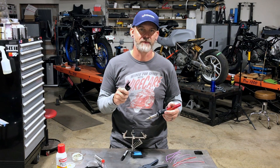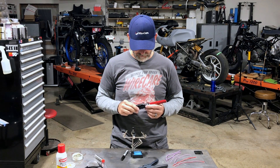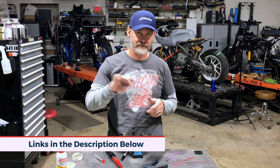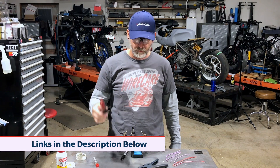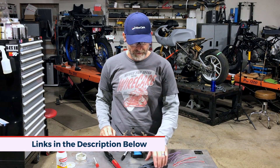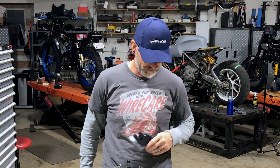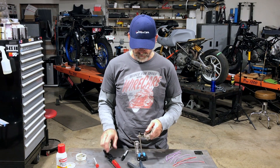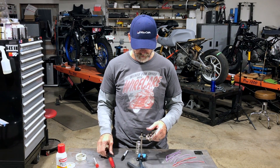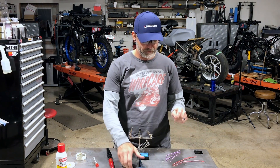We have found it extremely handy — we put an LED strip up here in the shop recently and it was nice to just grab it, go up there, solder the connections together, and done. We're going to show you some different techniques. You're going to need some safety glasses — always a good idea when soldering — some flux, some solder, your Ultra Torch UT-100 SI, the Pressmaster stripper cutter for stripping wire, and a third hand with a sponge for cleaning the tip and a torch holder.